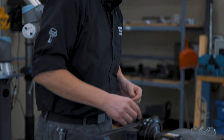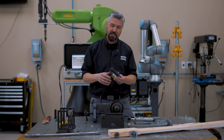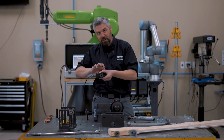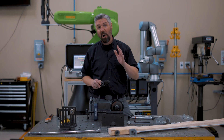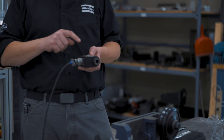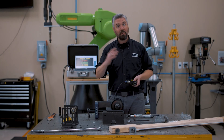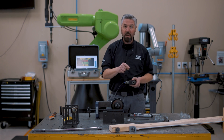Let's take a look at our calibration setup. This is an inline rotary torque transducer — what we call an IRTT. This is a super accurate way to measure the output of our torque wrench onto a test joint and actually measure the torque going into the joint. This is good to 130 foot-pounds; we're targeting 100 foot-pounds. We're going to output the reading from this transducer on the screen. Once we get to 100, I'm going to mark the wrench for that position.